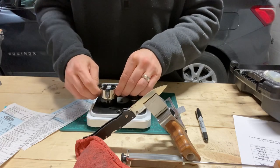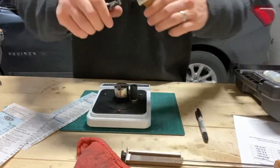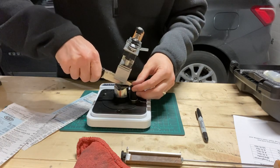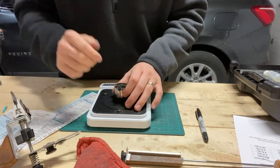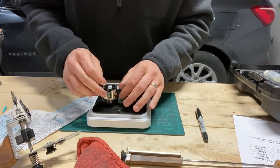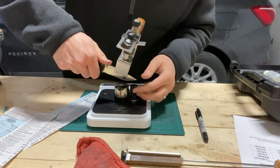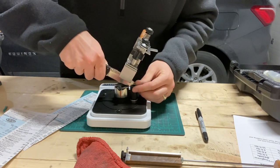Alrighty. So as best I can tell, a clean 1500 grit edge, he's got a BESS score at 18 degrees per side, .145. I think a big thing, angle plays a big part in these BESS scores. In some of the stuff I've seen out there, people are sharpening down to like 12 degree per side edges. I have not messed around with it much, but I think that's something to mention.